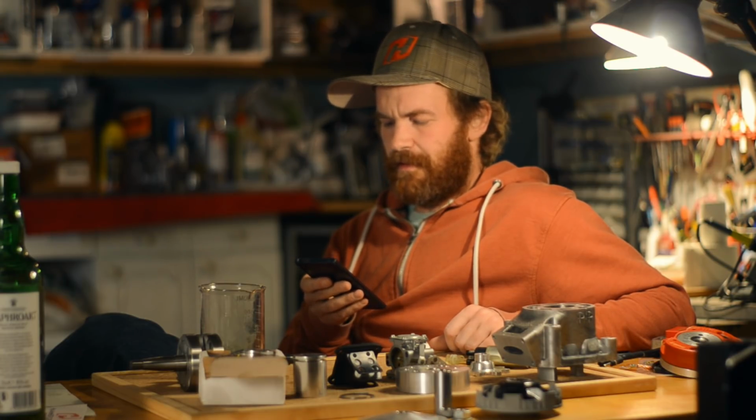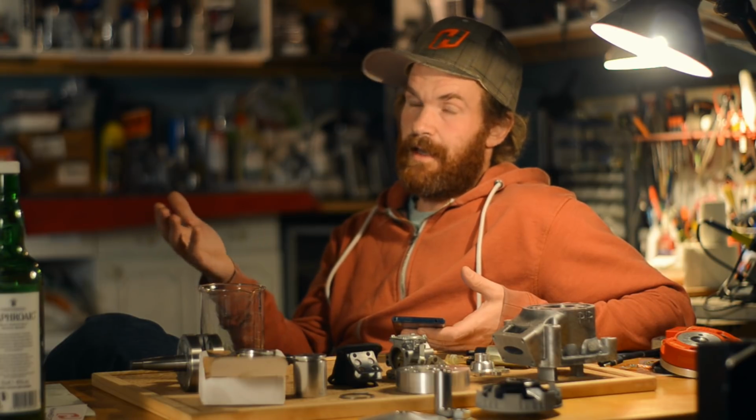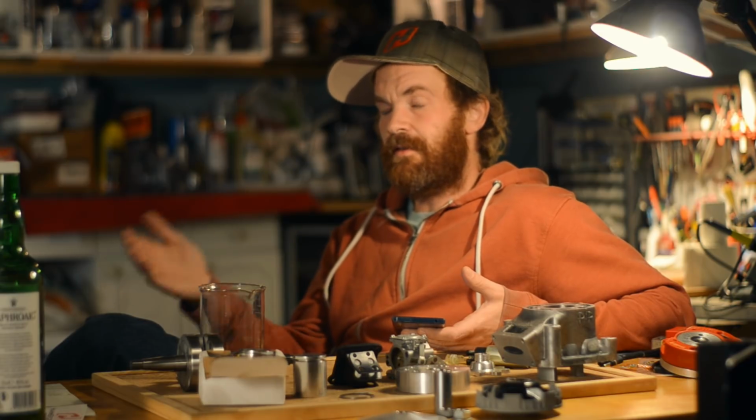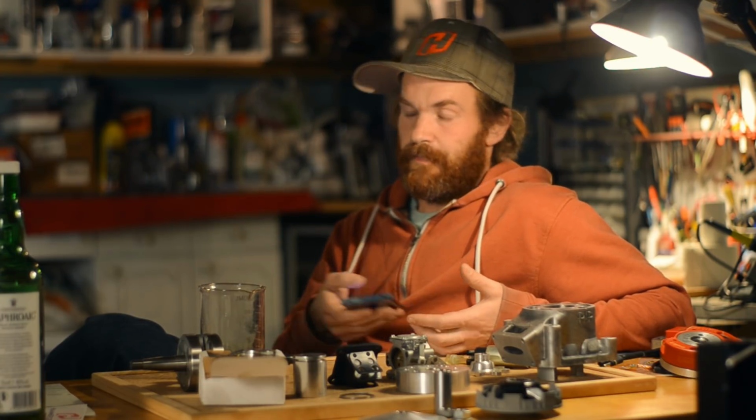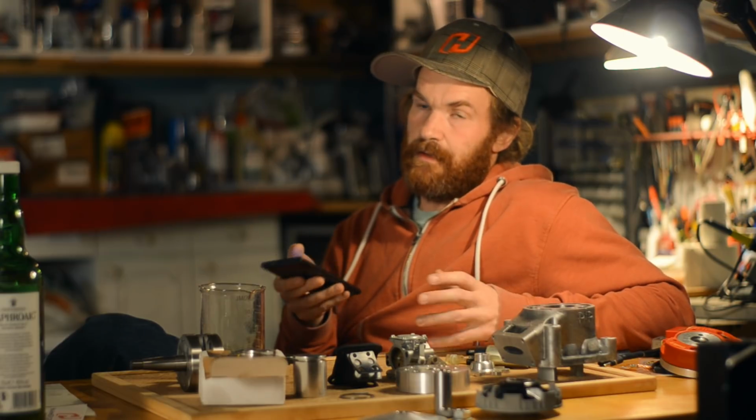Sounds like it has nice torque. Why don't you use a smaller rear sprocket for more speed? Well, actually the bike is geared, so when it's geared out fully, it's geared to do more than 130 miles an hour, which I know it can't do, or it shouldn't be able to do that. So it's geared higher than what it can achieve. And with the Variator, that's not a problem, because it will stay in the power band anyway, even though it won't reach gear out.